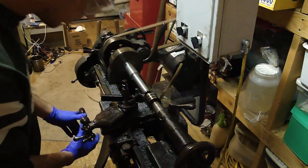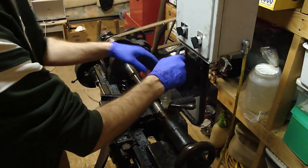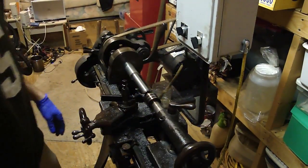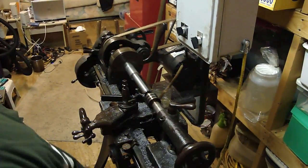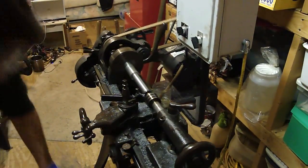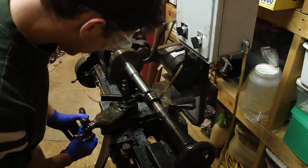There we go. My feed was a little too high because once I reduced that diameter down, now we're starting to peel off a nice curly chip. You can see what I was turning earlier - they were coming off, and I didn't put a breaker onto this bit.